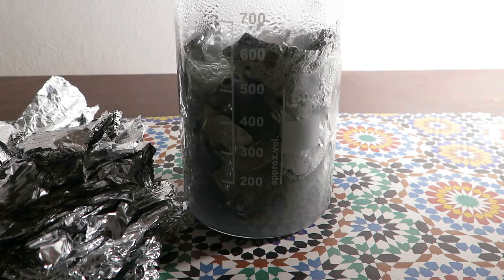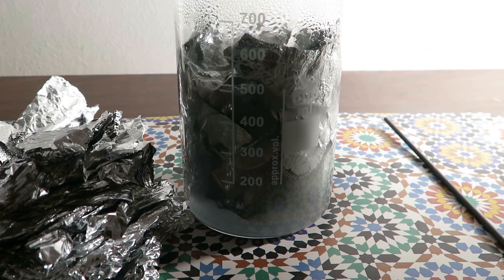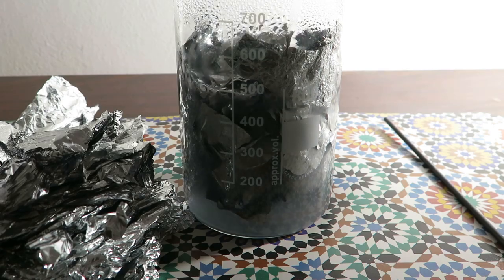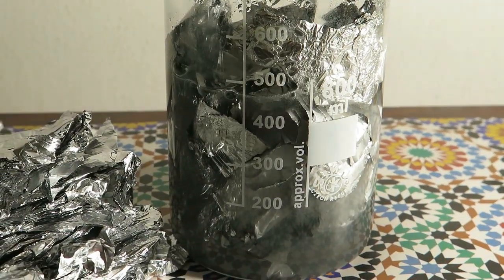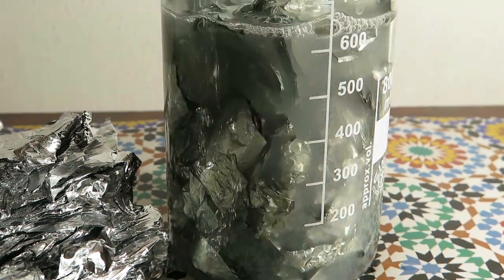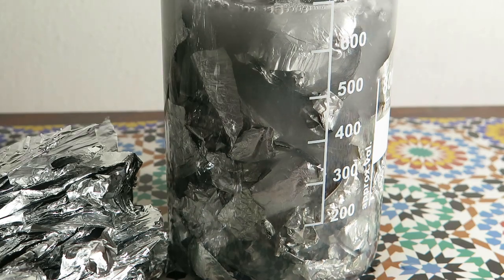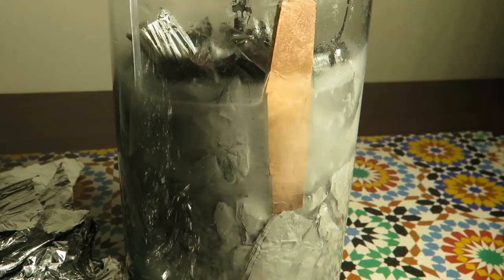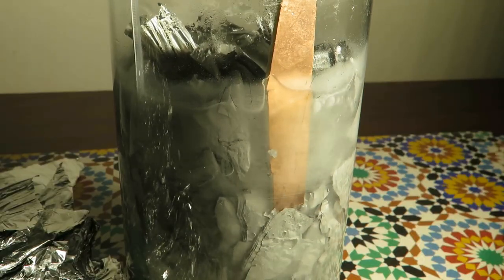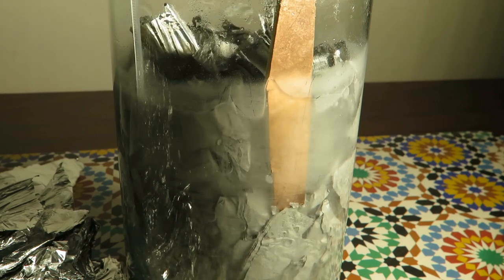With a big enough container you probably don't even have to stir things up. You would think that the sodium hydroxide would be consumed during this reaction, but I guess what happens in the water is that the sodium aluminate is actually quite free to jump from aluminate to the hydroxide form. Here you can see that the glass will be stained during this reaction, and I am putting some pieces here to further examine the staining, because it's quite interesting on its own.